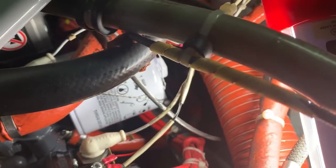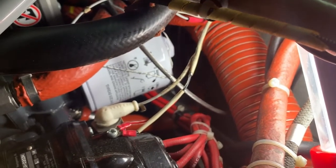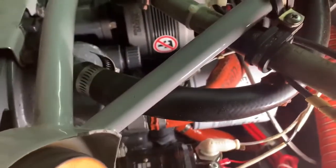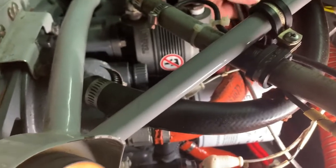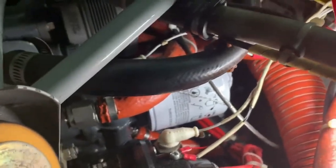Instead of going the same direction you rotated before, go the opposite direction for the next twist. My pliers have a selector, but most safety wire pliers only have one direction. When you pull it, that's your first direction of rotation. For the next twist you'll have to do it by hand in the opposite direction — that's what I have to do with the pair I got from Aircraft Spruce. Nothing wrong with them though. I also have some bigger pairs from Aircraft Spruce for doing heavier safety wire.